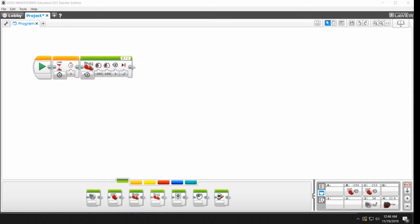And you don't need an opponent for that. You can do it yourself. You can tell your robot to turn on for 10 rotations and it'll drive itself right across the ring. So instead of making a giant number right here, you might have found that it took 5.5 rotations or something like that to go across the ring. But what we're going to do instead is we're going to set these values to forward direction because we want it to charge across the ring, right?